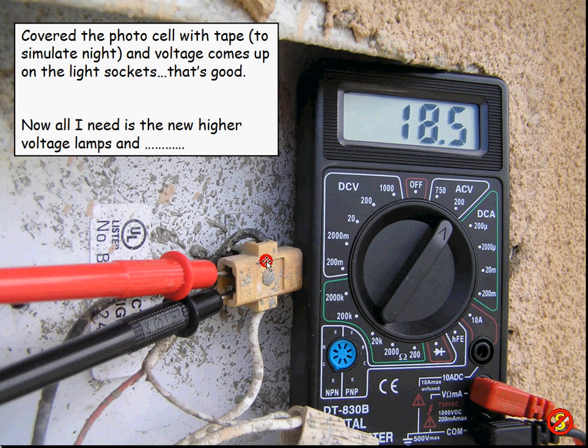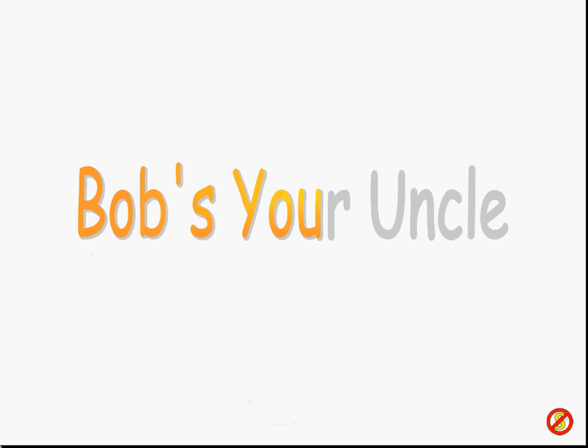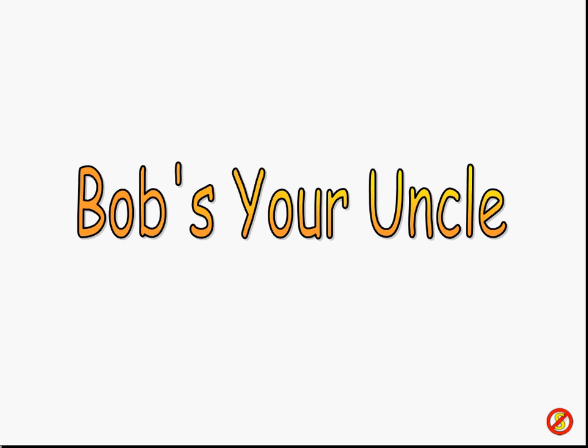Unfortunately I don't have the higher-voltage bulbs yet — I'm going to stick 24-volt bulbs in there. As soon as I get those 24s, which should last a long time because I'm driving them at 18.5 volts so they'll be a little dim, they should last another 10 years — probably longer than I will last. All I need is the new higher-voltage lamps and Bob's your uncle. Probably most of you won't need this, but basic troubleshooting for these kinds of things is like a doorbell circuit. A doorbell operates very similarly: you've got a step-down transformer, a power supply feeding it, wire going over to the bell. So even if Bob's not your uncle, I'm done.